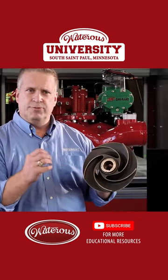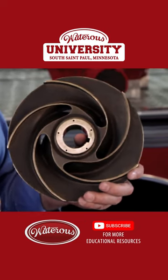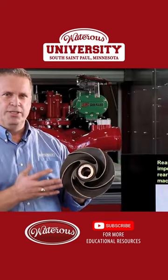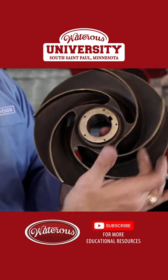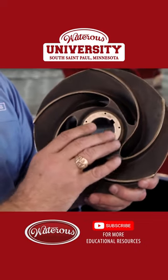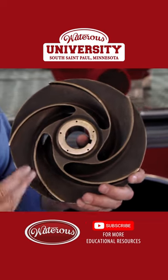Centrifugal actually means the force starts in the middle and makes its way towards the exit way. What an impeller actually does is adds velocity to the water — speeds it up, makes it move faster. This side of the vane will hurl the water out of the impeller, send it out towards the exit way, and out into the pump body to the discharge side of the pump.